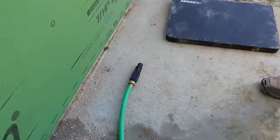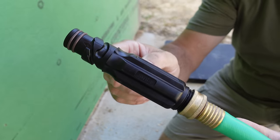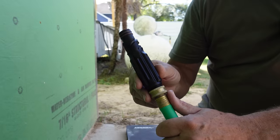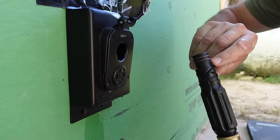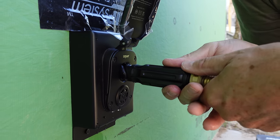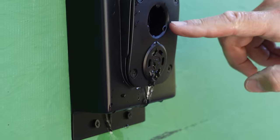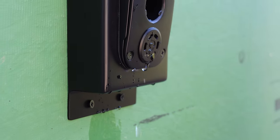Let's go outside and show you how cool it is to hook up the hose. We have a little six-foot hose hooked up to this Aquor eco-friendly polymer connector — check out the two O-rings and all these grooves. To turn the hose on and get your water going, there's a little arrow here — just put the arrow on top, push and turn clockwise. We've got full flow on the other end of our hose. And it's just as simple to stop — turn counter-clockwise, pull it out. There's our water draining out of the body. So now if it freezes tonight, we're totally protected.